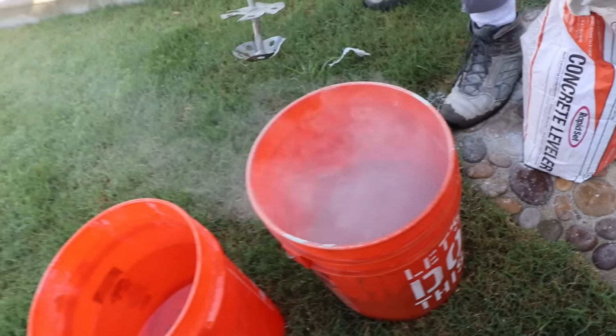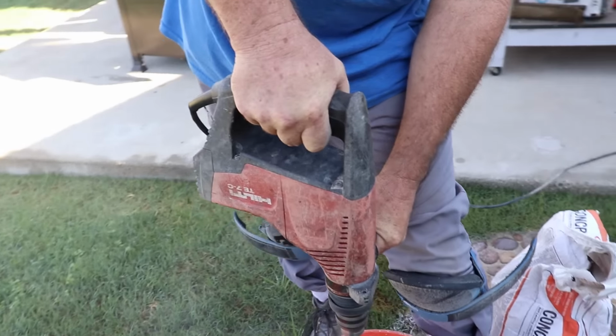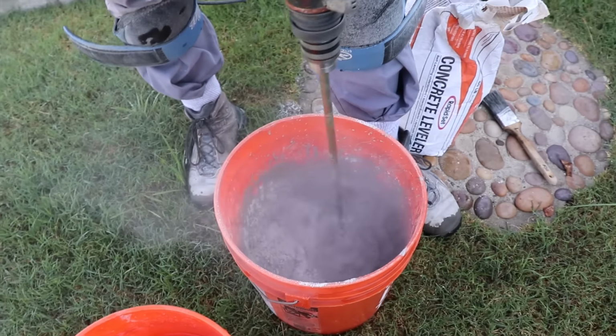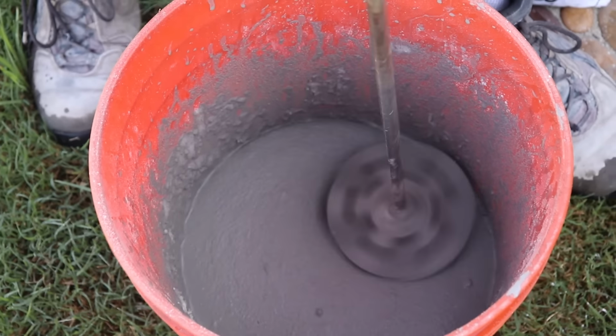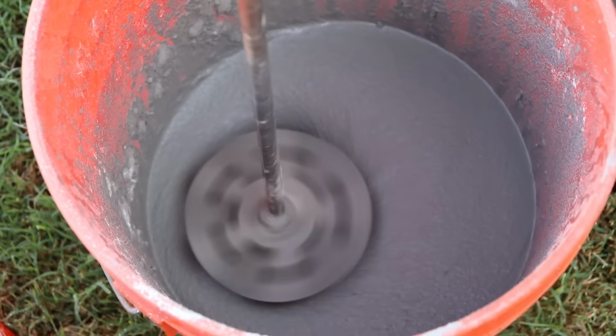So depending on how much water you need to divert and how fast the slope is down towards wherever you're trying to divert the water from, you can put multiple channels in and then really catch any overflow. If one channel doesn't handle everything, you just throw another one in there, 2 or 3 more, whatever it takes.